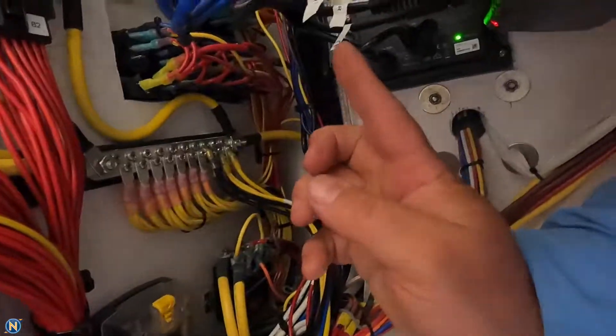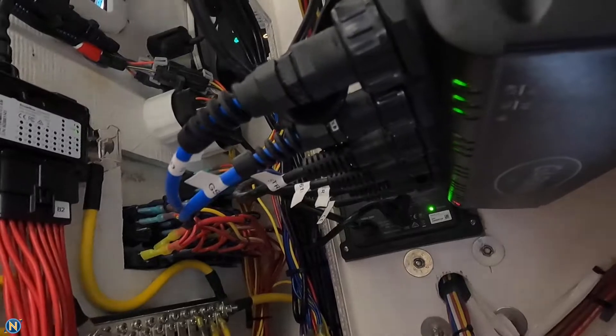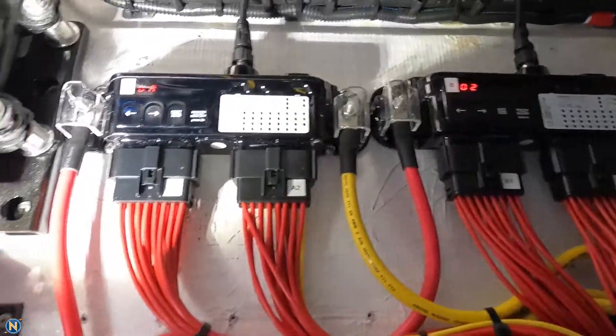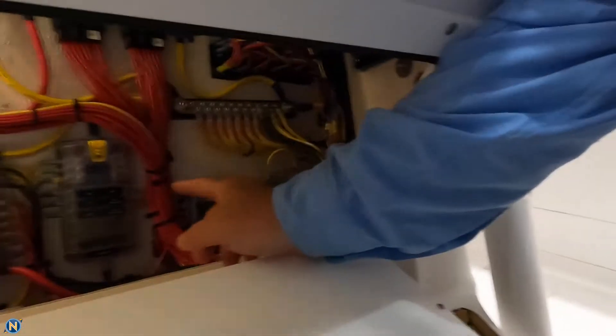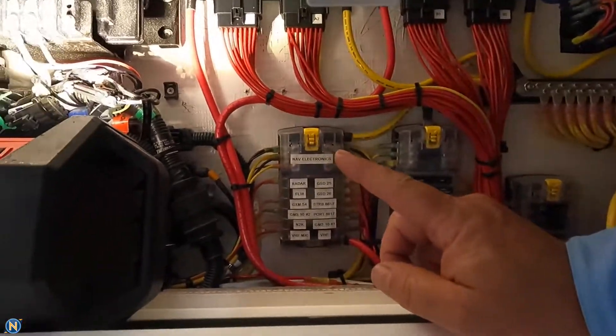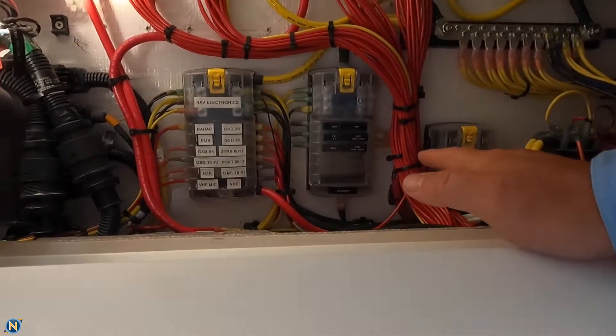Now if we take a look up inside here, you're going to see this black box right there. That black box is our WDU — that's going to be our graphics driver. And then as we pan around over here, we see these two black boxes — those are going to be our Connect 50s. So as we go ahead and slide that out of there, those Connect 50s are actually what's doing our switching. If you look and see, there's a bunch of red wires coming off of that — we call those our flying leads. Those come out of that plug right there and go down into our connections, and they're all labeled right there so we know what to hook them up to on the boat side.